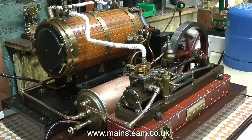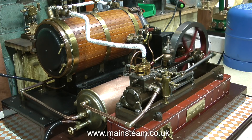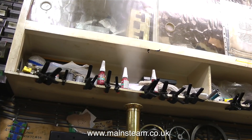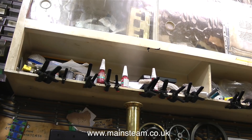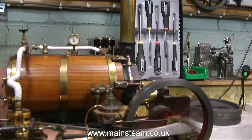I'm putting some more oil on because I'm going to run the engine very fast. This engine has a tiny bit of play on the small end on the crosshead so it does occasionally make a tapping noise, but it's nothing. I'll fix it when I get round to it — it's certainly not worth making a video about.